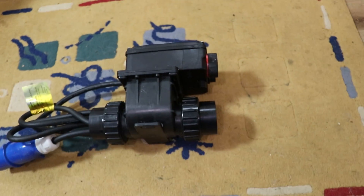I don't even know if the flow rate is going to trip the little switch inside. Inside these heaters, so that they don't run dry or run when there's no pump on, there's a little metal flap that comes down like that and the water pushes against it and operates a little relay. You can just hear it clicking when you push it - so the water's got to push that to operate the heater, or the heater won't run. So you don't know exactly if the flow rate is fast enough to push that switch on. I really wish there was a little light in it - I think eventually I will get some little LED lights off eBay and wire it in so it just lights up when the heater's on. But for now it should be on - I've set it to 20 degrees and I've heard it click.